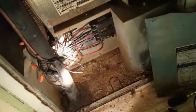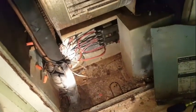And then we can get on to it. We'll open this up too, take a look at it. It says the power's on, so we'll check that as well. We have an E2EB012, which is a 12 kW furnace. Those breakers were awful hard to get turned off. In fact, I had to push them so hard. We have our fan relay up top, sequencer at the bottom, transformer in the middle right there. Pretty simple inner workings, just a lot of wire coiled up. They get a little bit more complex, but mainly it's a bunch of wires everywhere.